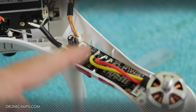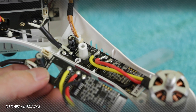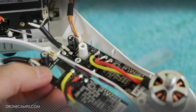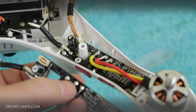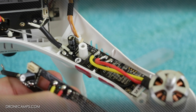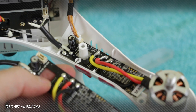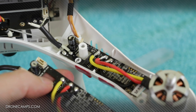Now we've got our wires soldered onto the ESC board from the motor. Make sure you look at your other ESC to confirm that your wires are soldered on correctly. Take special care when soldering onto the board that you don't get solder touching each individual section, because it could cause a short. Also make sure you don't get too much heat near some of these chips on either side. Try to use a pin-style solder gun so you can get more precision.